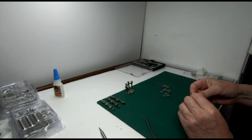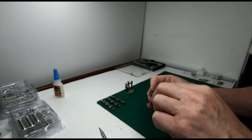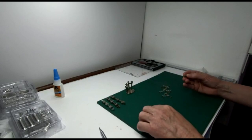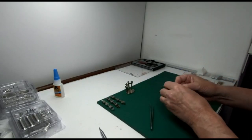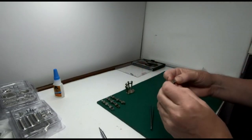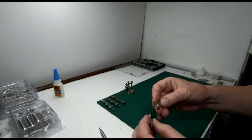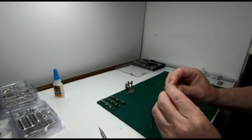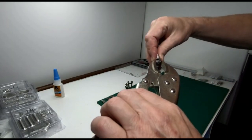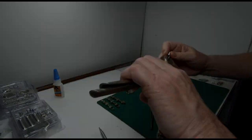And then what you do is you add the two 4M washers over the top of that. So you've got two 4M washers. I'll just twist those over, actually. That way. So you've got two 4M washers in the middle of that. Then you get the next part, clip those together, and then all you do again is click that through. So you just, with your pliers there, push those together so that it clips into the next one as well.